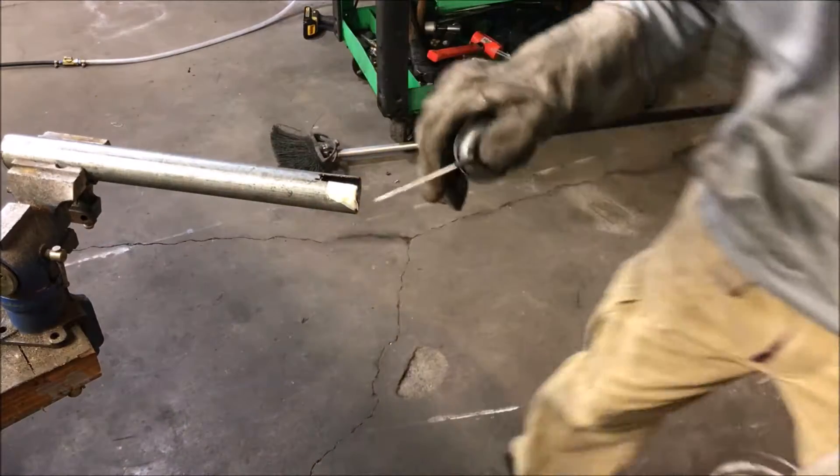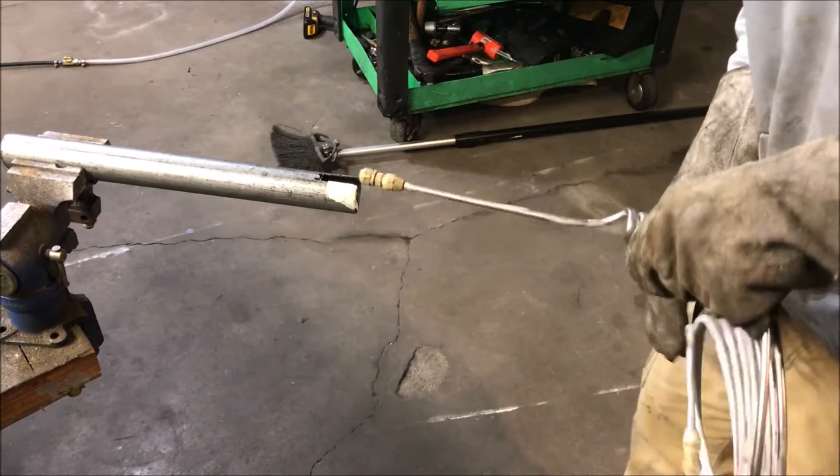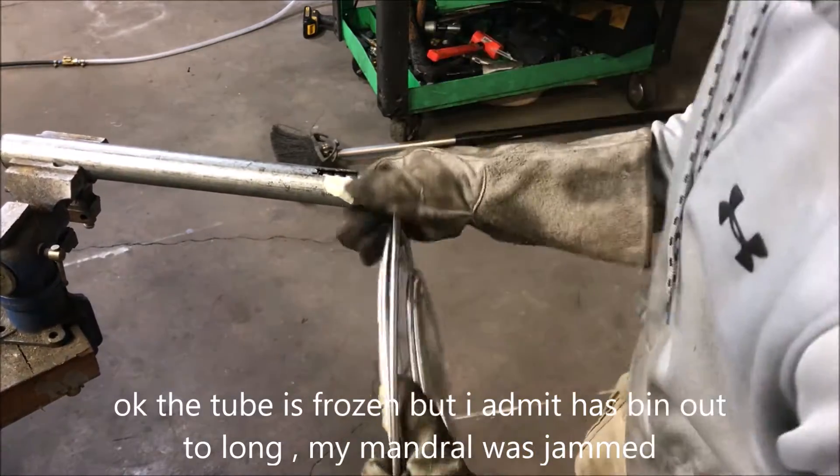The reason that's important to me is because in the past I've been reluctant to freeze the water in the coil, knowing that it would expand and alter the wall thickness of the tubing — maybe make it weaker or even burst the tube. You can do it with copper but it stretches it and will burst it on occasion. Putting a contaminant like dish soap in the water alters the bulk modulus in such a way that maybe the ice won't expand enough to burst the tube.